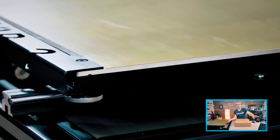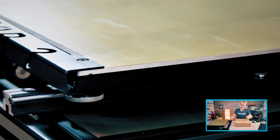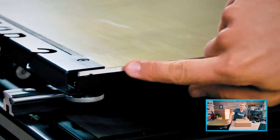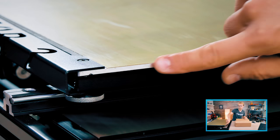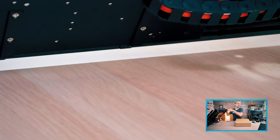It does have a, where is it? Yeah, it does have a silicone heater underneath. So this is a 4-ish millimeter aluminum sheet on top, which, if you've seen the heated bed comparisons, is exactly what I like to see on these printers. And the undercarriage is relatively thin, like 2.5 or 3 millimeter aluminum too, with a space optimized construction.